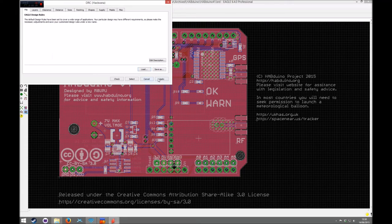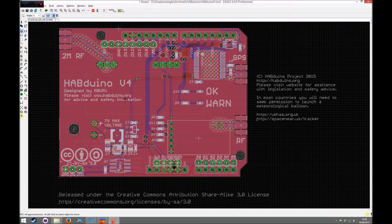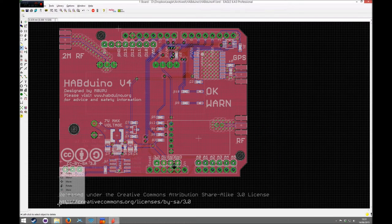This one probably will have a few failures. Possibly not, I've already checked that one. At that point, you can save that board. I would make a copy of it, call it whatever you want, PAN. Delete the resulting schematic and just open the board file, because you're going to be duplicating this, so if it has a schematic, it will complain at you.